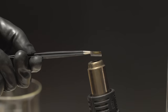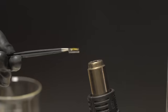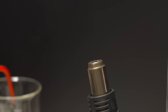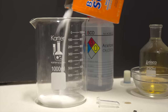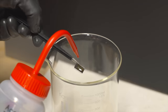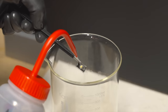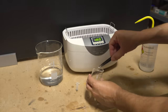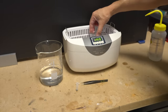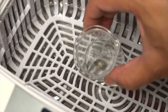If we heat the nitric acid at the same time, it will accelerate the reaction. As the acid reacts, it eventually is no longer effective and must be rinsed off using acetone. I'm rinsing into this bowl which also has baking soda in it to help neutralize the acid. We keep repeating this acid-rinse cycle until we get to the silicon. Now that we've gained access, we can clean it with some isopropyl alcohol in an ultrasonic bath — like a massage at a day spa after spending the morning drowning in a bath of acid.